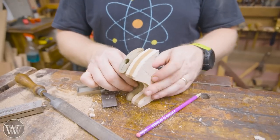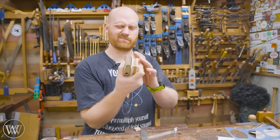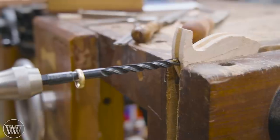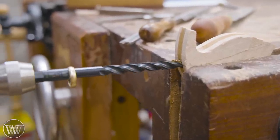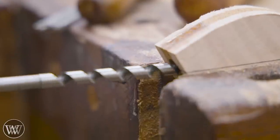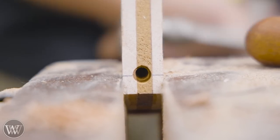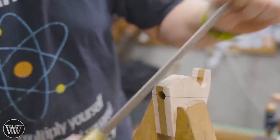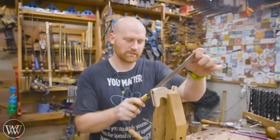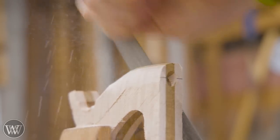Before I go any further I'm going to drill a hole. Sometimes I like to do this as a block — the Veritas plans have it as a block so the cut is at 90 degrees to the angle of the hole — but this one's angle is ever so slightly different than normal Stanley sizes, so I want to make sure it matched the original. We're going to run some test drills. This is where the brass ferrule will go on top, so I need to make sure I'm only going down so far. When working with auger bits, always do the big bit first and then come in to the smaller bits. There's also a larger hole on the bottom as a recess for the thread in the casting, and we drill from one side then the other until the holes meet in the middle.